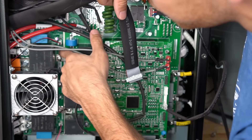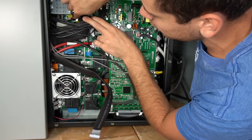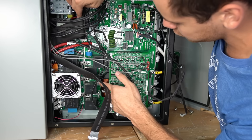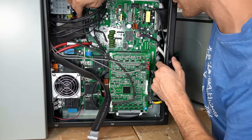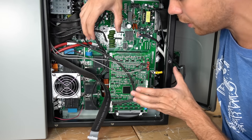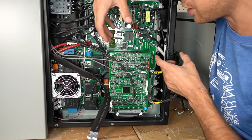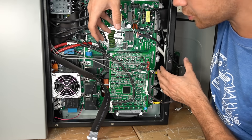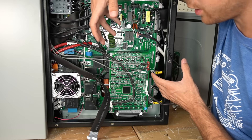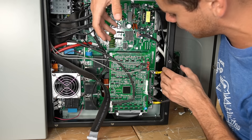Look at the size of these bus bars connecting this PCB to the other one. The MPPT circuit is deeper on the other side — this board handles the control circuit, transfer switching, and some of the inverter circuit below. In the back there's a massive bank of capacitors. For this model it's advisable to pre-charge those capacitors with your own resistor. Don't trust a server rack battery pre-charge resistor because you don't know if the duration is long enough to charge up this massive bank.